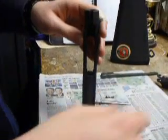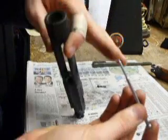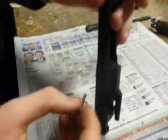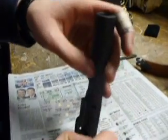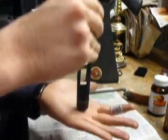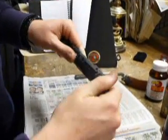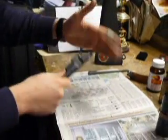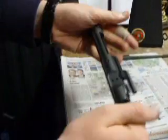Put the firing pin back in — the point goes down, drop it in there just like that. Then you put your cotter pin in this little tiny hole right there. The cotter pin goes in that big hole and the tip comes out that tiny little hole right there. Now test to see if everything's working: if your firing pin falls out, you did it wrong — start over. Push the extractor in, back up, and go — it should fly to the extended position. Make sure everything's smooth and working. Bolt is back together.